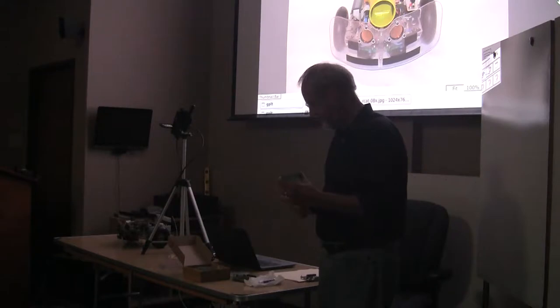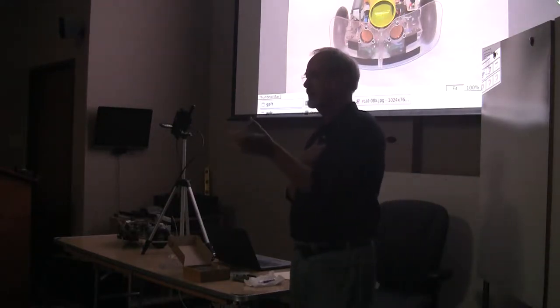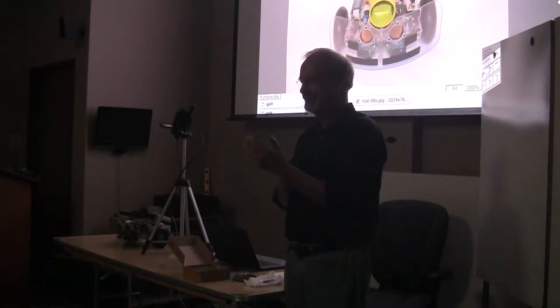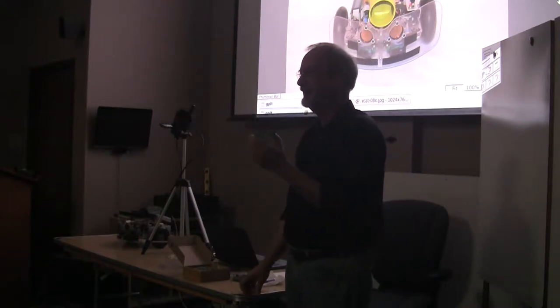The downside of this, for me, is that when Ron designed these boards, he designed a whole bunch of little bypass caps, those little tiny surface mount things, which I can just barely see, much less solder onto a board. Talking around, I was told the right way to do that is basically you glue them on with some kind of flux and you melt them in a toaster oven. And James has done much of this and is an expert.